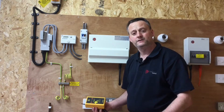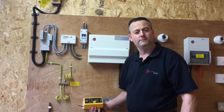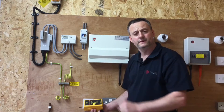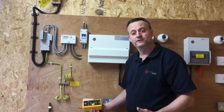It's important this test is done first and that we don't go skipping off around the installation doing earth fault loop impedance tests, only to find that we haven't got a supply on the line conductor — which is simply a case of reverse polarity on the supply authority side. So we've got to do the tests in the correct sequence. Our first live test is recheck polarity.